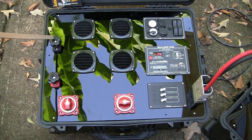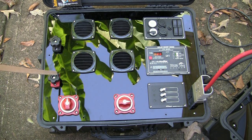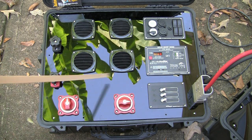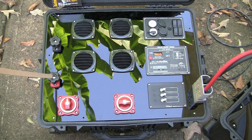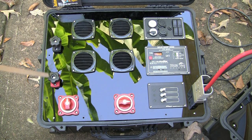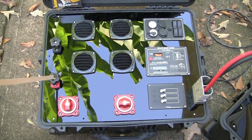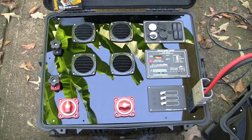They have a 100 amp quick blow fuse underneath the panel inside of here, so if I don't need the full 1500 watts, if I just want to provide power to some of the kids' computers and a couple lights, I can run a smaller inverter off of these 2 terminals. Plus it gives you a spot to hook up your battery buddy.